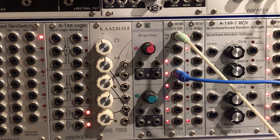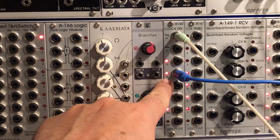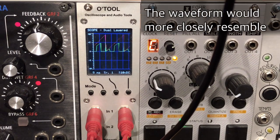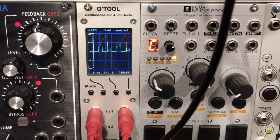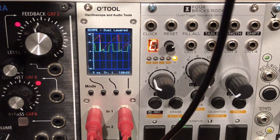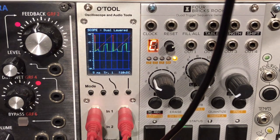To get a sub octave two octaves below the main pulse wave, we use a clock divider. In this case, divide by four will give us one that's two octaves below. On its own it sounds rather plain, but once you start playing with the pulse width you start to hear how interesting it can be. Then we bring in the modulation, and that's starting to get a bit Hoover-like. Now let's bring in the PWM itself and a sub octave two octaves down — and that's sounding rather good.